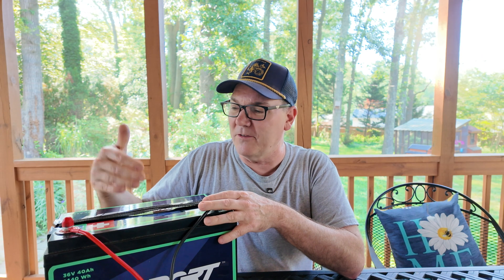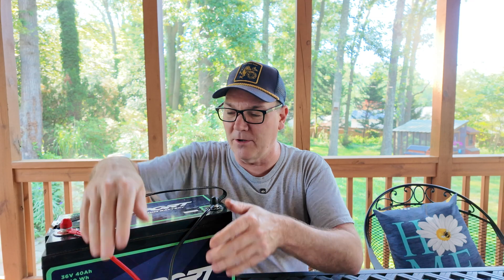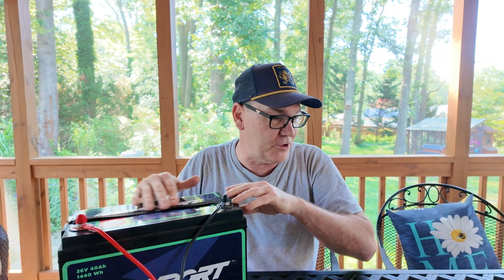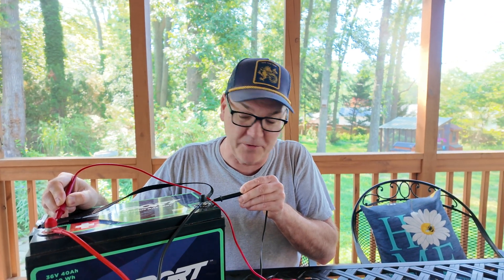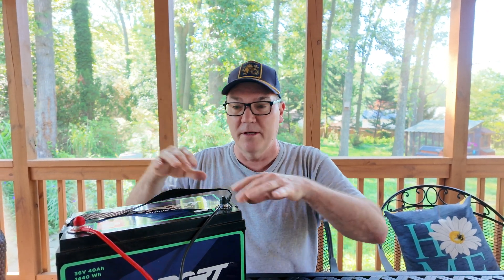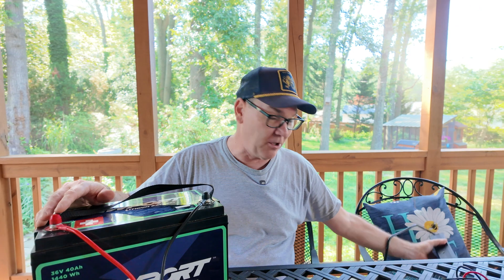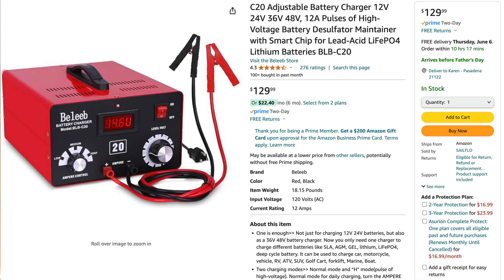Which brings us into another aspect about lithium iron phosphate batteries. Apparently they're not supposed to ever be run down really low like this one did. How it ran down low I don't know — maybe because I had a connection still hooked up to the terminals. It's down to 2.3 volts. Some people say you can use a different type of battery charger to try to bring it up to where it's reading voltage, and at a certain point switch over to the appropriate lithium iron phosphate charger that tapers off and shuts off the way it's supposed to. There are chargers out there that can charge from zero volts.